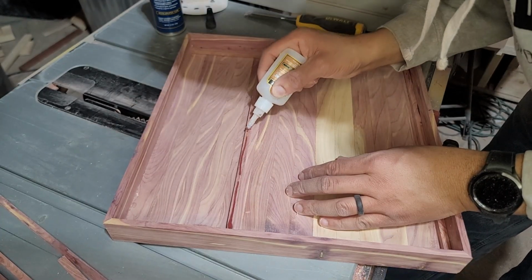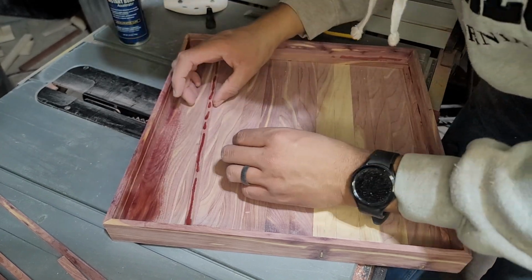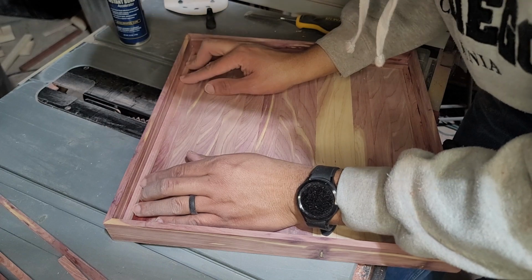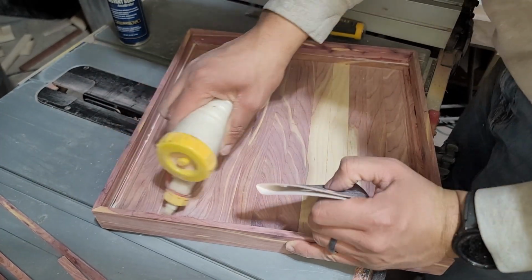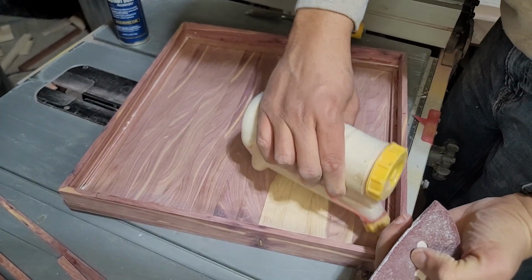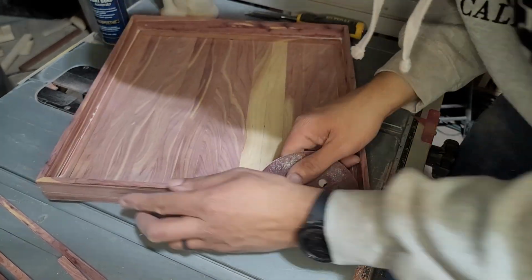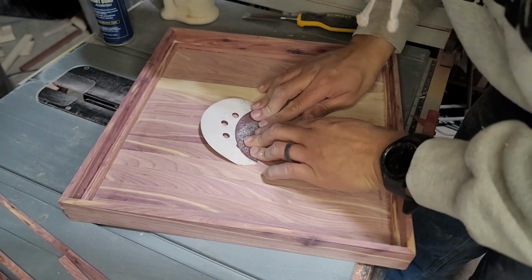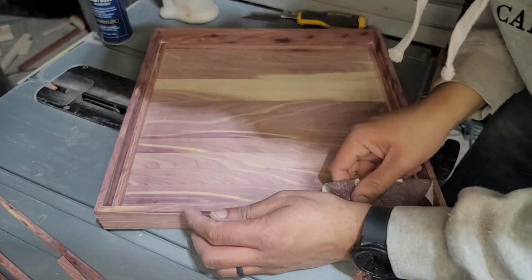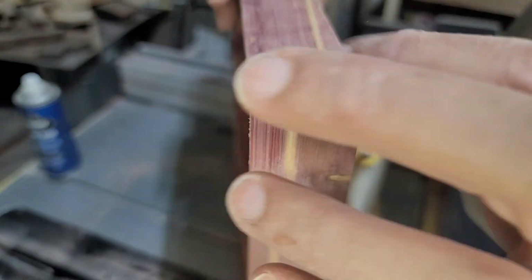So I actually wanted to put a small profile on the inside. These extra little pieces are going to help reinforce the bottom box to the side. I had this fear that the bottom would just fall out. I don't know why, because wood glue is pretty strong, but I thought maybe those little extra pieces would help give a little bit more strength. So I went ahead and installed those, put an extra little bead of glue around this, sanded it in just to help fill in some of the small cracks. I did the same thing on the mitered edges, a little bead of glue, a little sawdust creation, a little magic, and voila, these were all good to go.